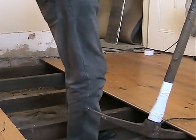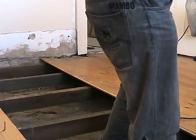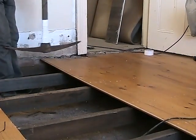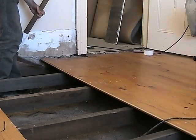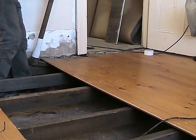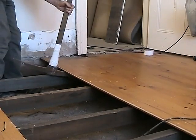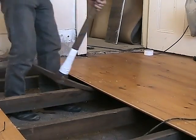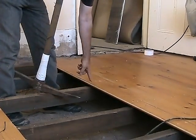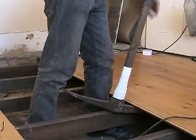It's quite a tedious process and there will be some breakage here. Some of these are coming out with very well-preserved tongue and groove; there will be some casualties. Overall I think it's worth the effort in order to not put this timber in landfill, where it would become a source of methane and aggravate global warming. After doing this across the full length, it will be possible to take out at least the first plank and then continue gently levering them all up one plank at a time.